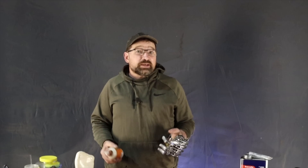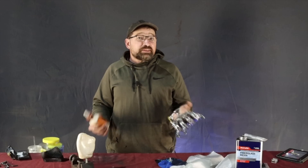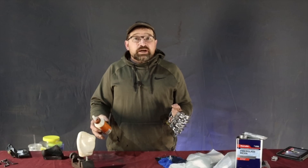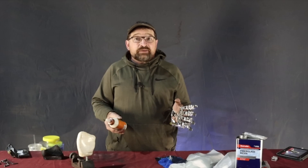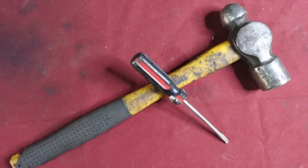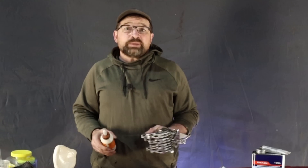There are all kinds of different products you can use as release agents in fiberglass. I've just had really good luck using Gorilla wood glue for plaster and resin. Just be sure that whatever you use, coat the entire surface of the plaster so you don't have any porous surface showing, otherwise you can have issues getting the fiberglass to release. I use one, maybe two coats max.